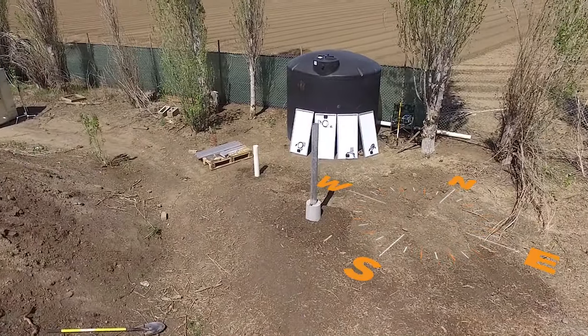In addition to the low well sensor, we also have inputs for a tank full sensor. This can go into a tank, a horse trough, or wherever you're pumping your water — when the water level rises up and touches the sensor, it's going to tell the pump to turn off and prevent your tank from overflowing. This is the exact same sensor as the low well sensor and it's stainless steel, meaning there are no moving parts to break over time. We're going to get this sensor installed on top of our tank and then do a final hookup to our controller.